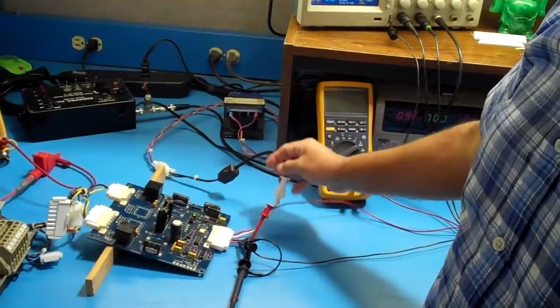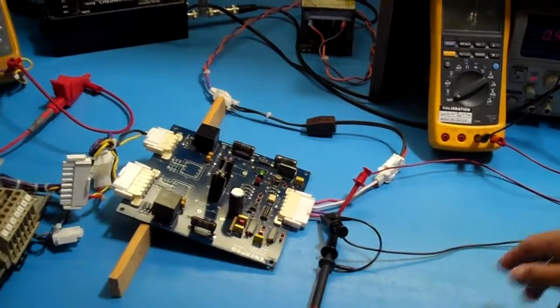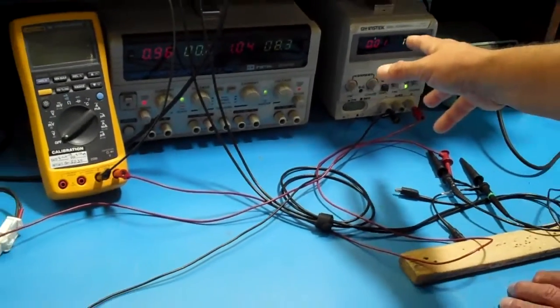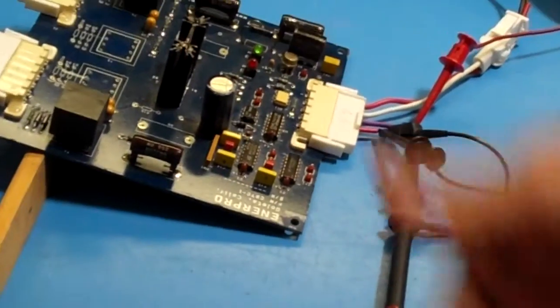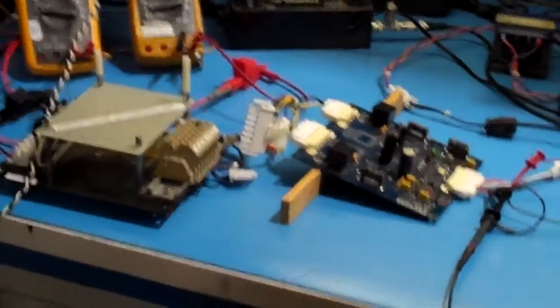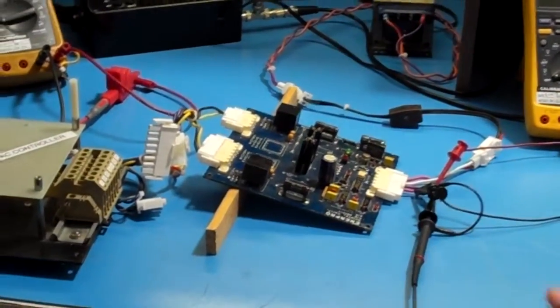Here we have the same load, and the way it's set up is we have 24 volts AC going for control input power, and the logic right now, which could be reversed, is we have a current source, the 12 volts, actually 6 to 10 volts, that if applied, nothing is happening. We're not crowbarring, we're not enabling. So what we're going to do here is, when we remove those 10 volts, this board will basically fire, and again it will fire at any given time.